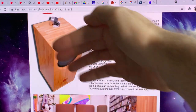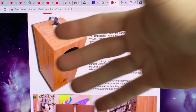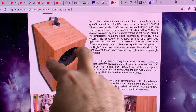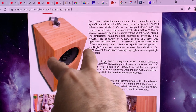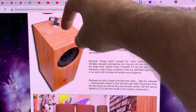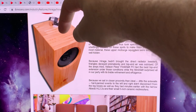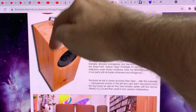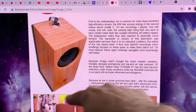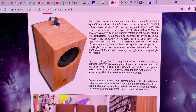That part of the air pressure your driver creates propagates in the front, and it's responsible for frequencies down to about 300 Hz — because the driver is capable down to 560 Hz and the front baffle helps bring it down to about 300 Hz. Then the back pressure of the cone is used by the cabinet to convert it to lower frequencies, which exit through the port and fill up the response below 300 Hz. That's how bass reflex cabinets work.